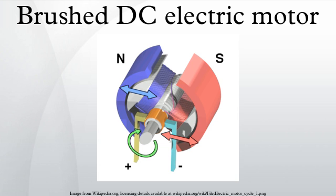A problem with the motor shown above is that when the plane of the coil is parallel to the magnetic field, that is, when the rotor poles are 90 degrees from the stator poles, the torque is zero. In the pictures above, this occurs when the core of the coil is horizontal, the position it is just about to reach in the last picture on the right. The motor would not be able to start in this position. However, once it was started, it would continue to rotate through this position by momentum.